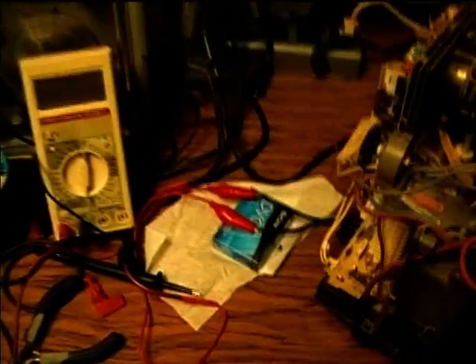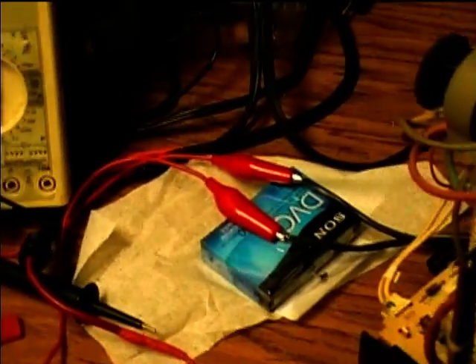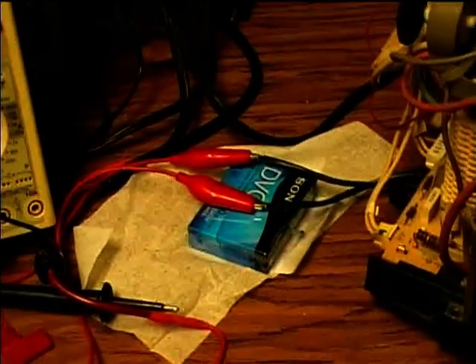So now I just got to rewire the power cord. I've got it hooked up with an alligator clip cord now because the old power cord had been spliced, so I'm going to redo the splice job and solder it and use heat shrink tubing on it. Then I can get it hooked up to the DTV converter and check the actual picture performance.